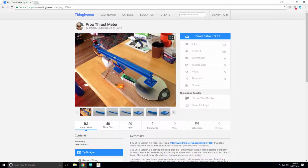So now we have 50 grams of force. Now we have to have this moment arm here. Let's say that that is in meters. Let's just say that for whatever reason that's 0.5 meters. So that's 50 times 0.5, so that's 25 gram meters, which sounds really weird, because usually they're either foot pounds, inch pounds, or Newton meters, right? So you could do this with any measurement, any sort of unit, as long as you keep them consistent between the two. Okay, so this is 25 gram meters, right?